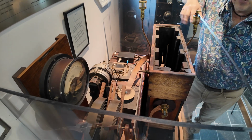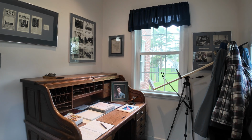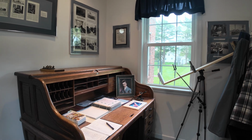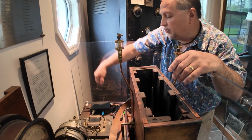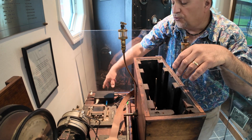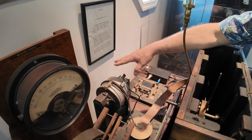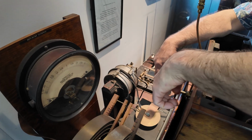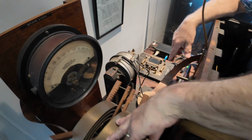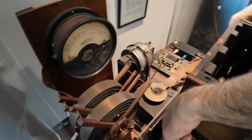Okay, so you can operate this? We can now operate this, correct. We activate the power. We're using low voltage for safety. Now, obviously, they did not have triac keyers in Hiram's time. But I have built here a triac keyer, which allows me to take the low voltage and then put 120 volts AC onto the high voltage transformer. Okay. When she's working, she will generate 12,000 volts AC. That voltage is passed through the condenser or capacitor and then the oscillation transformer. It's a straight instrument. It's then placed on these 2 points here.